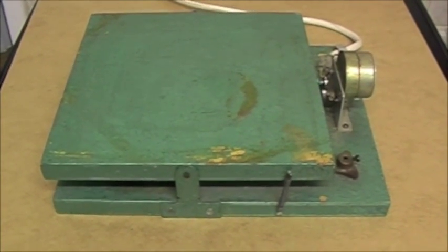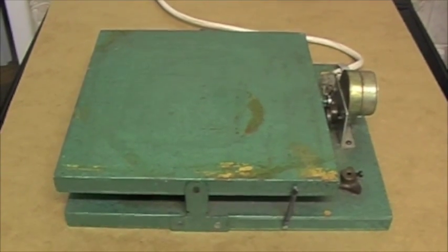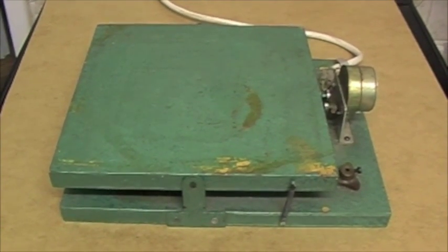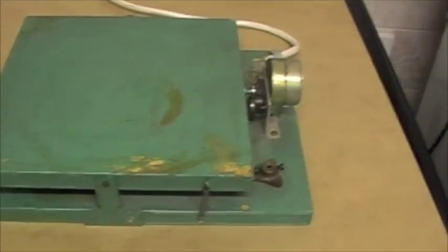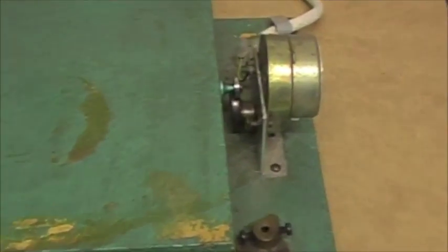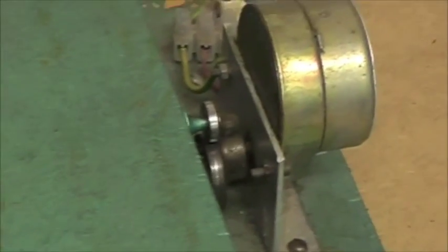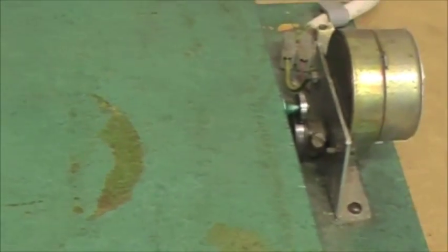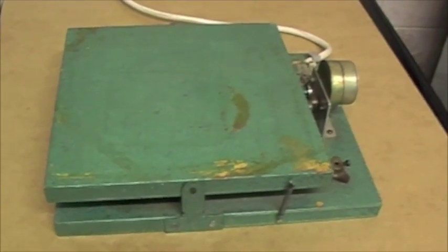Having to agitate the dish every 15 minutes for four hours or longer if you're using a used ferric that's not quite so strong — for single plates I made a little device which has a synchronous motor driving a cam and a miniature ball bearing against a spring. That device tilts 60 times every minute, so you can just go shopping and leave it to get on with it, which is rather nice.